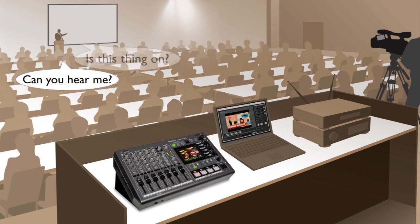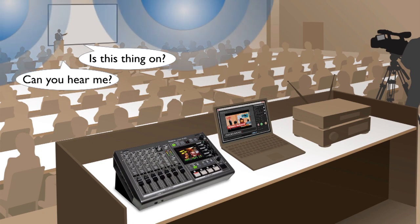You have a speaker and a Blu-ray player for playback at various times during the event. We've all witnessed audio level coming up late — either when a person steps to a mic and nothing comes out, or when playing back video and the audio is missing for a second or two at the beginning. That usually happens as a result of a fader being down. It is important to have that fader down to avoid ambient noise coming through mics or audio from video that is being cued up. With audio follow, you don't have to worry about the fader being up or down at just the right time.